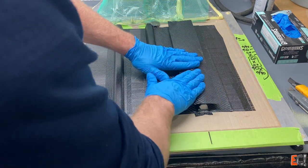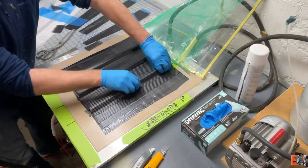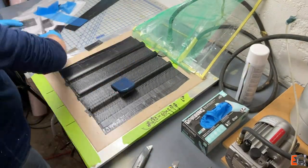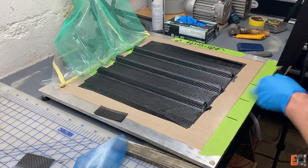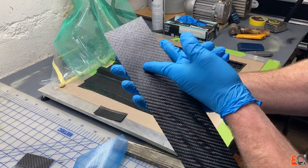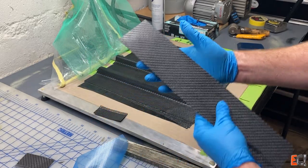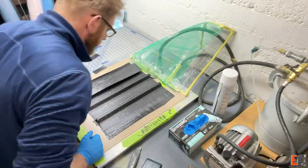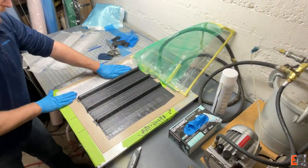and take some fussing, because it's not completely uniform and you have to stretch it a little bit here and there. But there's usually enough flexibility with the crimp to get a pretty nicely aligned set of plies. And you can see that line here that's formed by the 45 of the two under, two over, the 2x2 twill. And that's a really nice visual element to make sure that you get right on things that are going to be finished clear, because it just makes it look way better.